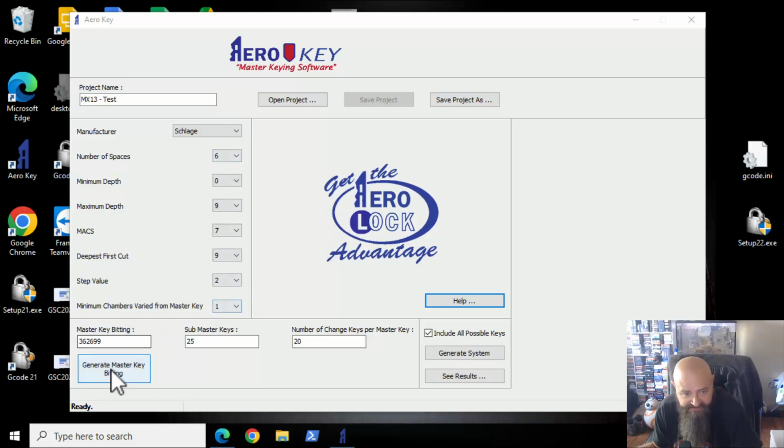Once you get all your specifications done, come down, generate, get one you like, and that's going to be the master key. That's going to be the Grand Master. So next is Submaster. So I'm thinking this is the downside of doing videos over a span of time. Thinking the clip right after this, I kind of go into, if you think about a master key system as an apartment building or an office building, the Grand Master is going to open every door on every floor. Submaster, think of that as floor 1, floor 2, floor 3. That Submaster is going to open all the offices or all the apartments on that floor. And then the change key is the individual offices or apartments.